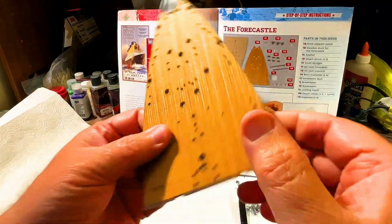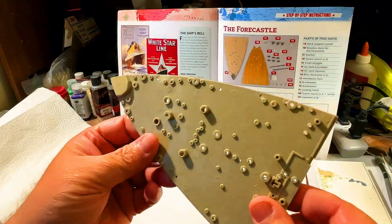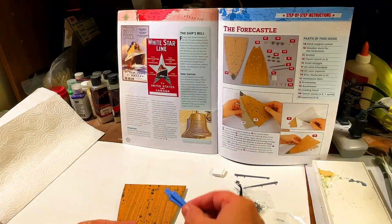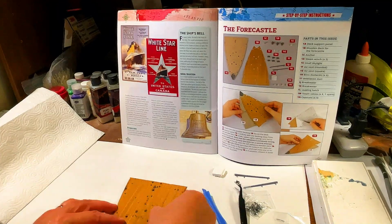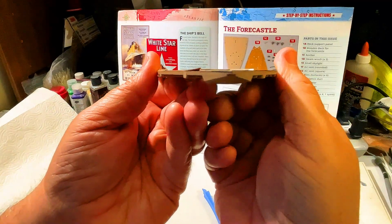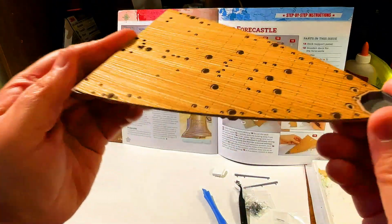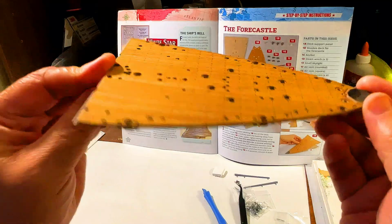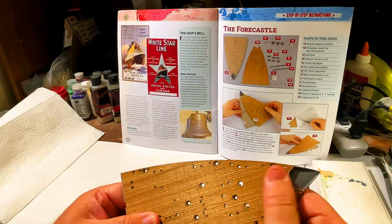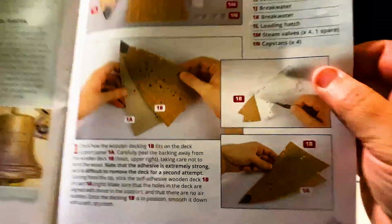There. Now, in addition to the adhesive backing that's on the back of the wooden planks, we also glued it with the wood glue. So you just want to make sure it's not going to go anywhere. Make sure we get the air out, and I think we did that when we went over it with the block. You can see it's nice and flat. There are no bubbles. Because if there are any bubbles, at this point you really want to get it nice and flat and smooth. All right, so that looks pretty good. So now we're able to move on. That's all set.